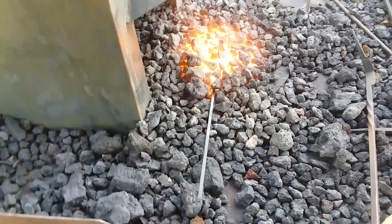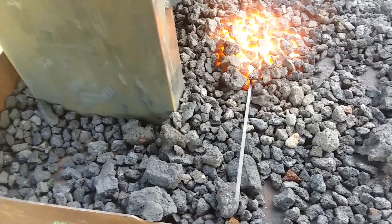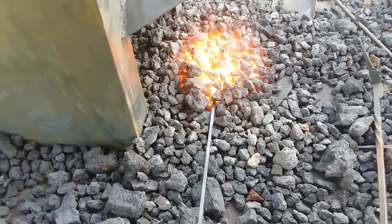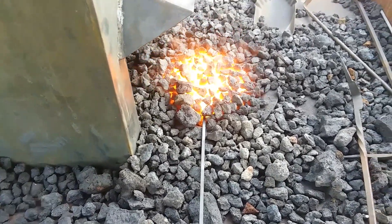Even when you are smelting, you want a fair amount of impurities in the material to act as a slag, which will coat your iron particles and keep them from burning as they get closer to the gas intake of your bloomery furnace.